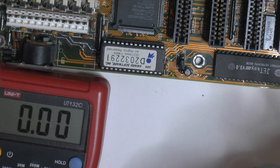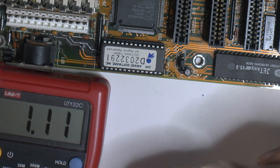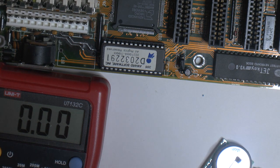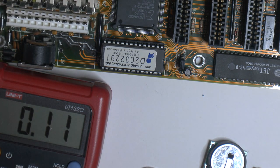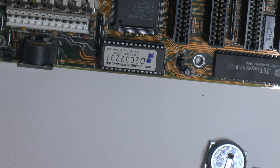2.9. So what's the voltage before the diode in this one? Before the diode, 3.25. That's weird. Why are some IKEA batteries shit then? I'm not joking, I was quite literally switching around the other day. 2.99, that's one I opened yesterday. This one is slightly used, I think. 3.06. Mm, this one is. Yeah, well, we found a good IKEA one after 3 attempts then. That's good.